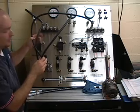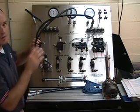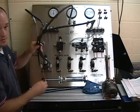We're just running it to an inline pressure gauge. But from here, what you can also do is run it to whatever directional control valves you're going to be running in the system that will supply pressure to your actuators.